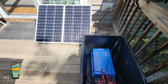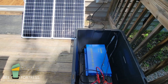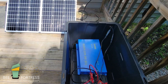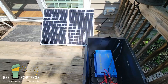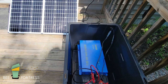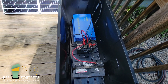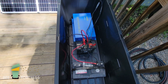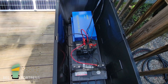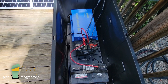We could put a whole bank of panels up to 3,000-plus watts, have a battery bank that could absorb all that energy and store it, and then we could power our refrigerator, maybe a microwave oven — a bunch of things up to 3,000 watts. There's a nice formula called PIE — P-I-E. Basic algebra: P equals power, or watts. Watts equal I times E. I is current in amps, and E is electromotive force, or voltage. Do basic algebra to figure out how many amps at a certain voltage a load will require in watts, and you can flip that around and solve for either watts, amps, or volts. It's a good formula to know.